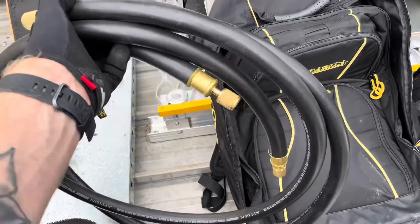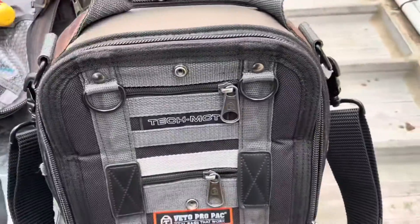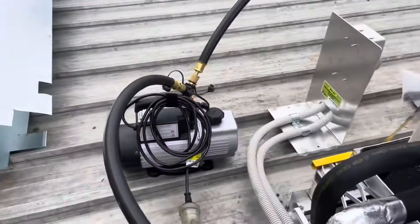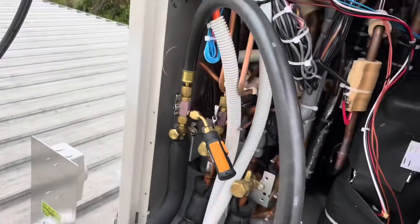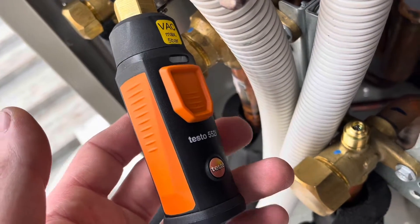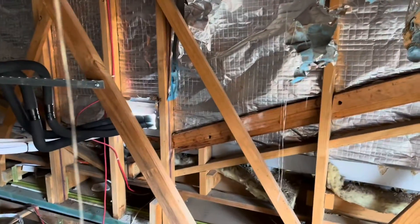Running with the Appion Mega Flow Kit today. Look at these big suckers — they mean business. So we're up and running now. Vacuum pump connected to the Appion T, which has the half-inch hoses coming off it. Schrader core removal tools there. And for the very first time, I'm using the Testo 552i. Currently got the unit on vac, which is basically just behind that wall there.